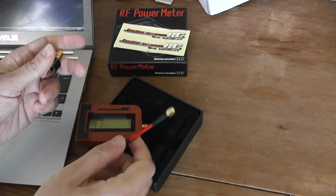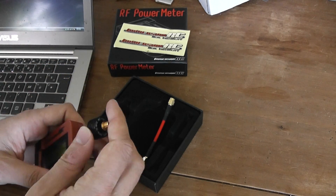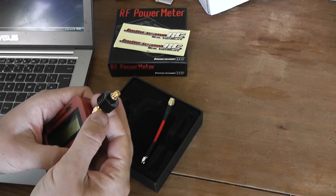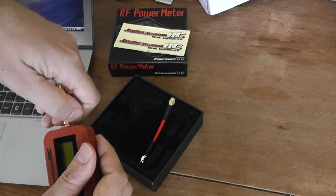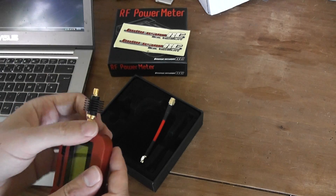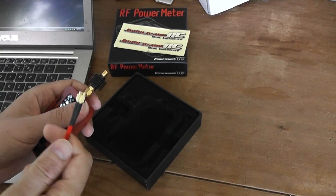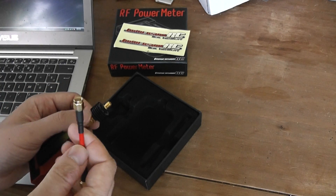I will make a small demonstration. I will plug the attenuator on top. Be sure to tighten all the screws well, because with such high frequencies — especially at 5.8 GHz — any RF leak will result in a drop in the measured power.